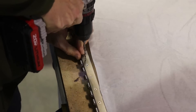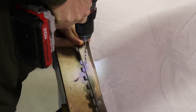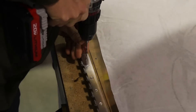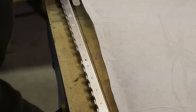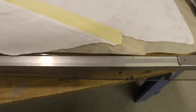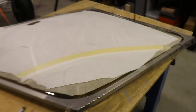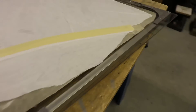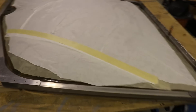I've marked the center of the top bar and I'm drilling that one hole for the one rivet that goes in the very top. On the back of the door I have one, two, three dots marked where I want to drill for rivets — so with those marked on the center line, I'll drill those. I'll do the back, then the front, then go around the bottom, and it'll be drilled and done.